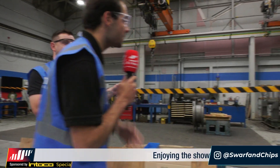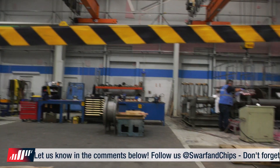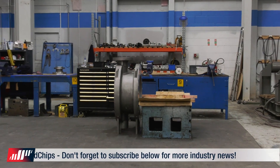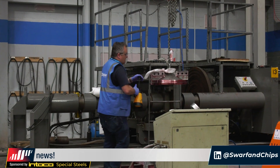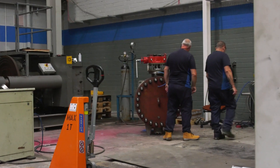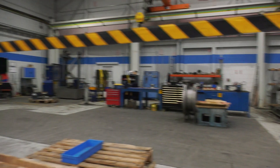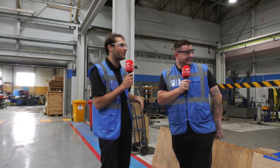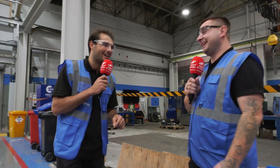We've finished up at the testing center. When it comes to critical applications in valve manufacturing, you need to make sure those valves are not going to leak - they've got one job. On the left is one of the Hastalloy castings as machined on the HNK; on the right is the bare cast valve body assembled with blanking flanges, and they're actually testing it right now at 80 bar of pressure - the same kind of pressure as a high-spec machine tool. These valves are going into ships as part of the ballast system, taking seawater in and then using the valve to keep the ballast in and keep the ship level. You're going to want that certificate to say it's been checked.